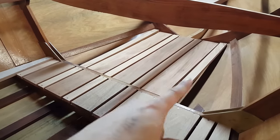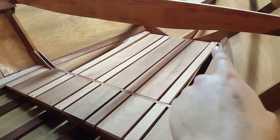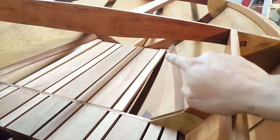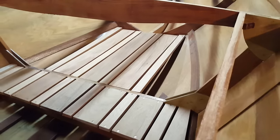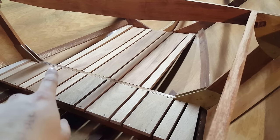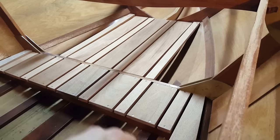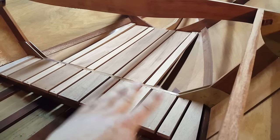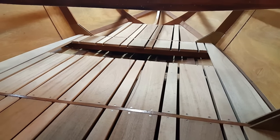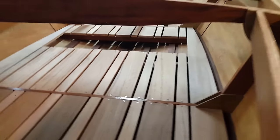We now have some of the forward planks cut — the two outside two-inch-wide planks. They're sitting on edge because they're bumping into the corner of the hull up here. Beginning around where my finger is is where I'll start my angled cut to follow the outside of the boat. I've got to pick up a little more material to do one more wide and one more narrow on each side, and I may put a tiny triangle piece in the corner. They're not drilled, countersunk, or screwed down yet — just sitting at roughly the right spacing — but the floor is turning out beautiful.